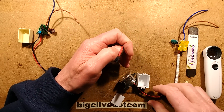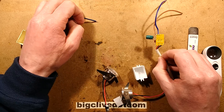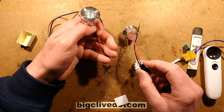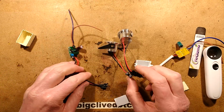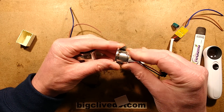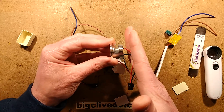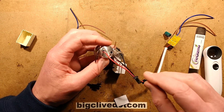They're nice enough little lights, but I'm slightly perplexed that they advertised one watt and three watt when the only difference was the power supply — particularly since the three watt one is designed to run three LEDs in series. Unless they intend a wiring arrangement to fan out and connect several in series from the one supply. Strange, but neat enough little lights. I quite like these little machined aluminium lights — they look smart. I like the whole idea of the lens being pinched in when you screw it shut, pushing the LED into good thermal contact at the back with just a bit of heatsink compound and no other hardware.